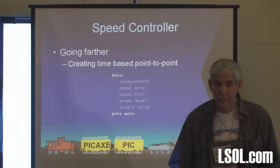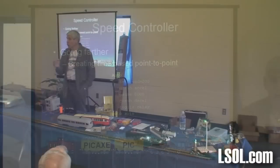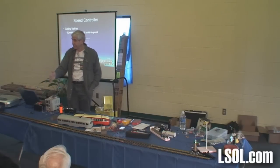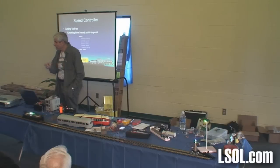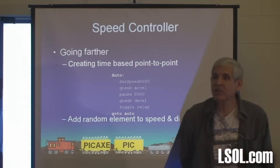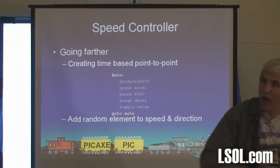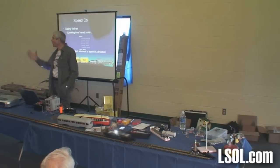You can do things like program a station stop. Absolutely. Could I put a station stop in? Could I say accelerate, pause two, decelerate, but don't toggle the relay — pause two more and then accelerate again? So what would happen? Zoom, stop, zoom, stop, reverse, stop. And could I have it doing only one direction? Yeah. That station stop — turn the bell, blow the whistle before you start. The whistle would not come from the train; it would come from the side. But if you put this in the train, which you could do — which is what I did with the trolley — you could do that. Could you put a reed switch where you wanted it to stop and run a wire back to this, and say if pin number seven is hit? Yes, you could do that and it would stop very precisely. All those things are possible.